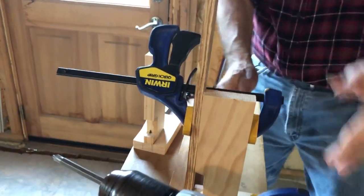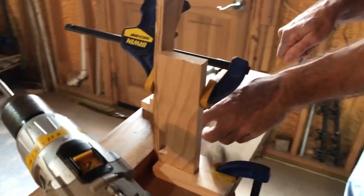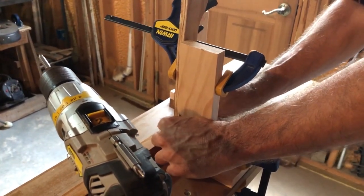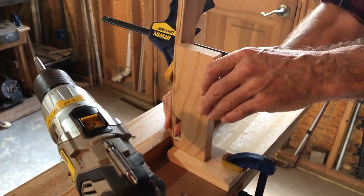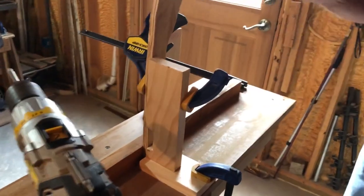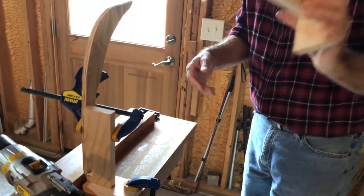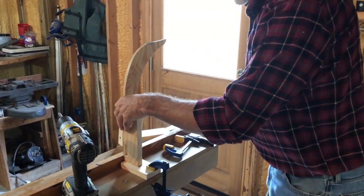So you come in, you put those stringers on, and then you notice there's a little gap right here. When you put the stringers on this side, you cut and fit them. But then when you go to glue them on or put a screw in or pin them — whatever you're doing — you clamp this back on and use that little jig to hold it in place. That way this thing stays dead straight the whole time — it's not going to move. It takes a couple of minutes to make these. I think it's a good way to keep your boat true while you're building it.